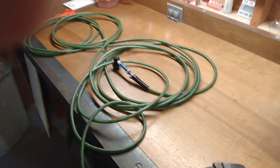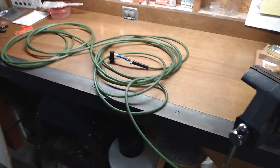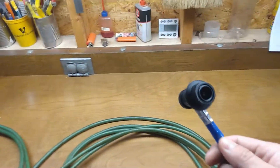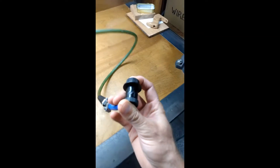What I'm doing now is purging all the air out of this hose with nitrogen. We don't want any atmospheric air to go into your tank because it could have moisture in it, and under compression that moisture is going to precipitate out — and now you have water sloshing around in your tank. You can hear nitrogen coming out of this hose. With the air purged, I'm going to back the regulator off and hold my finger over the connector so the nitrogen stays in and the air stays out.